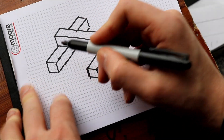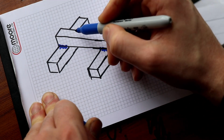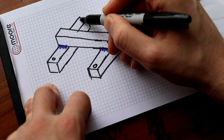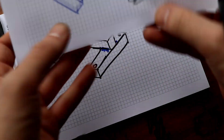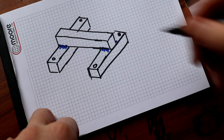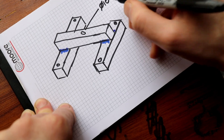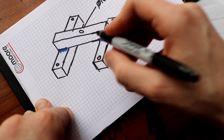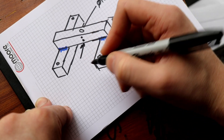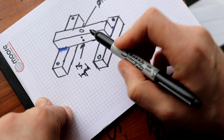So that's what it's going to look like. There's going to be welds sort of in here and then the corresponding sides holding these bars together. Then there's going to be screws here holding it to the head — no head screws like that. And then the plan is there's going to be a 10 mil reamed hole there to hold two bits, and probably four mil — maybe M4, M5 — let's go M5 — tapped set screws to hold the tool in.